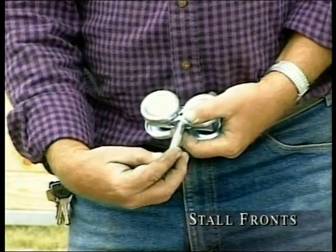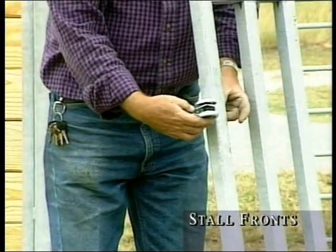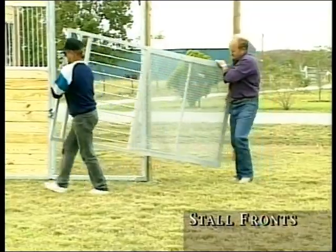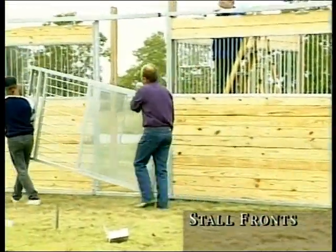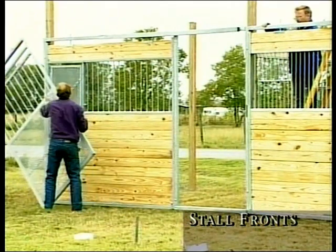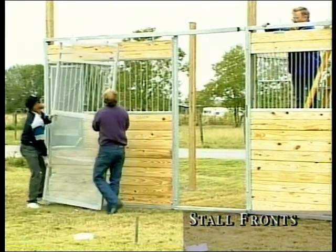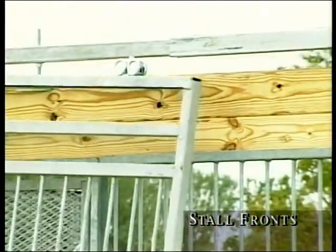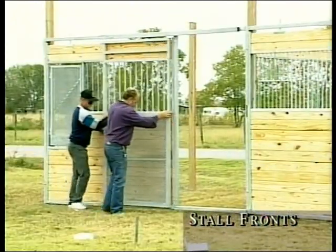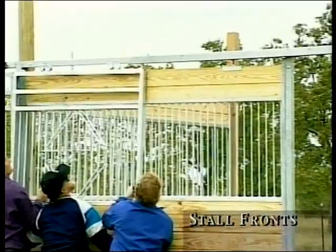Each roller has a pin to which you add one nut, the locking nut, and insert into the slotted hole in the top of the door. Secure with another nut inside the door frame, tightening only enough to hold the roller to the frame while hanging the door. Leave this nut loose until you are ready to hang the door, because it will be used to level your door and make it hang away from the wall. Slide the rollers into the track, keeping the rollers straight, and slide the door to the stop on your post. You'll repeat this process for all doors on your stall front.